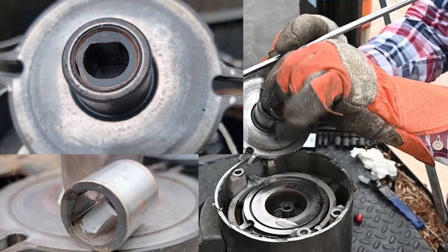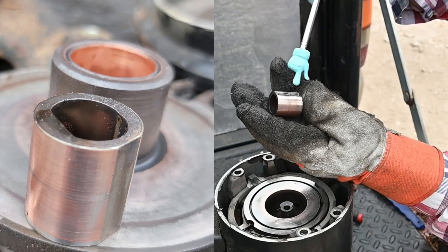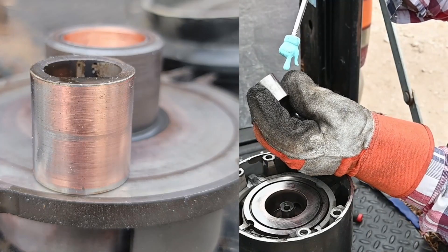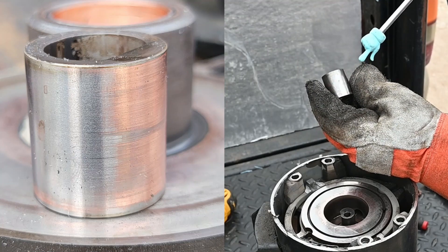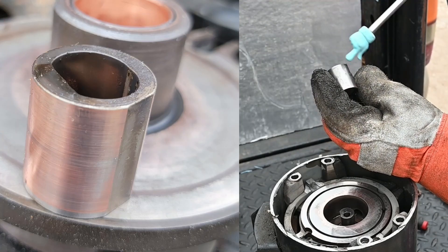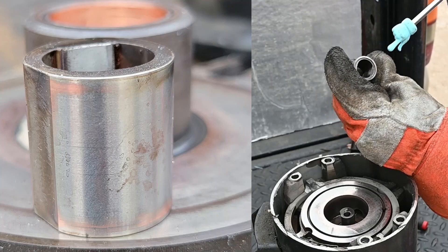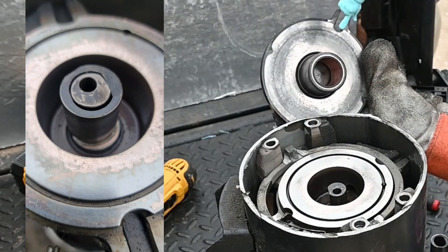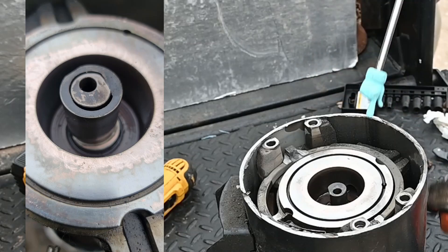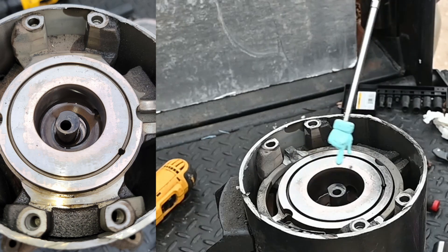This is the thrust bearing that fits inside the bottom of the orbital scroll and also in the very end of the crankshaft. There are signs of wear here that look like they're from some refrigerant flood back — at one point in its life it ran with low superheat and caused some wear. There's a little bit of copper plating right there, and the copper plating is even worn away. Probably when there was a refrigerant leak, somebody overcharged it, which washes the oil away from this bearing and caused that wear — but actually it's not bad. I've seen newer compressors that looked way worse than this. The lubrication comes out of the hole in the very center, lubricates up inside this bearing, lubricates this thrust bearing, and lubricates all these moving pieces. We can see some galling happening right here, most likely from either the overheat or refrigerant flood back.